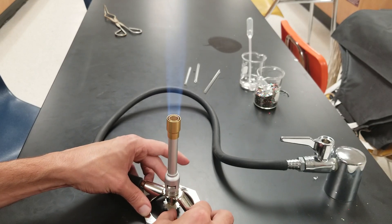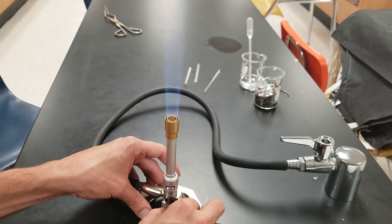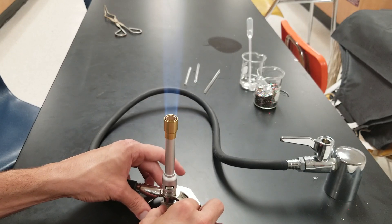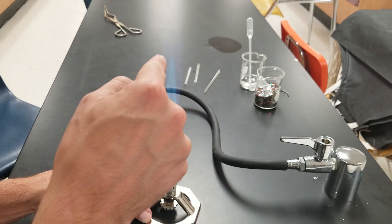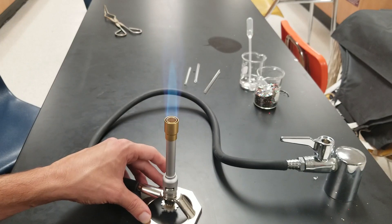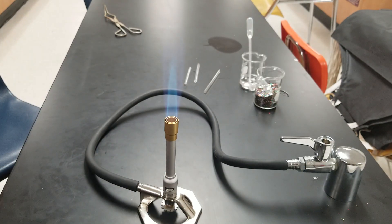I've got it turning on the bottom and I'm going to reduce the gas flow. As I reduce the gas flow — there we go — the inner blue cone, the bright blue inner cone with its hottest part right at the top, becomes much better defined, and you can even see it right there in the video. So now that gives me to the point where I'm ready to work with glass.